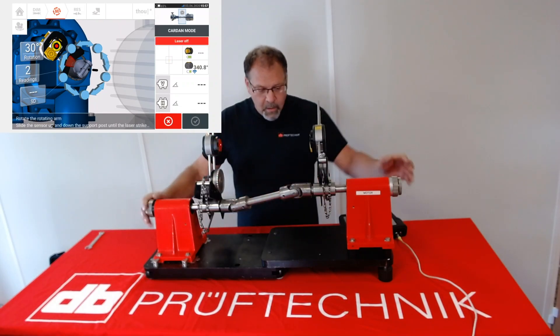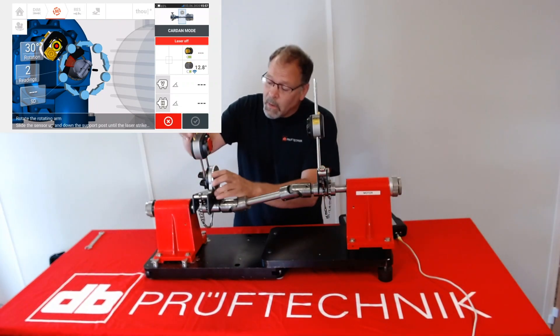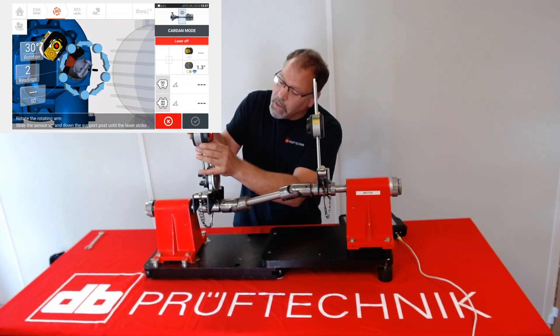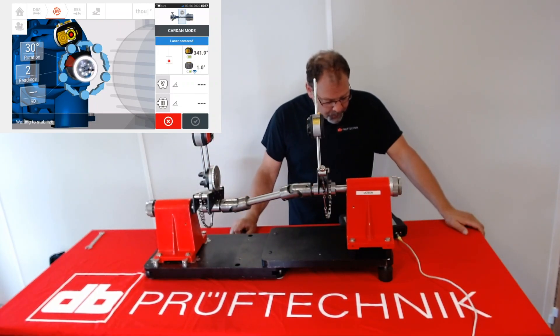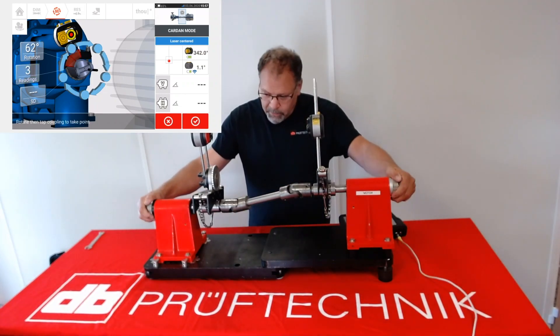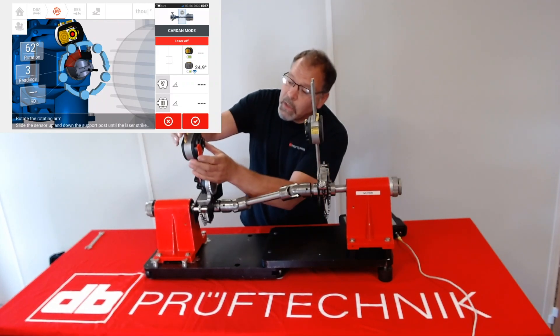Close the target, turn the shaft another section of rotation, loosen up the spinner, let the slide go, re-lock in the sensor, tighten the slide, open the window, and watch for stabilization again. You won't take a measurement unless it's stable, then simply push the M button just like in the directions. You're going to want to take at least five, but get as many measurements as you can in as far of a rotation as you can.